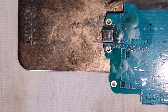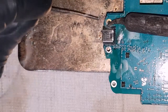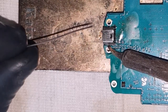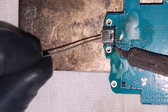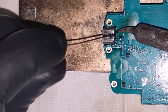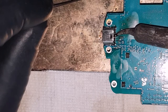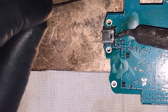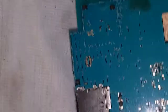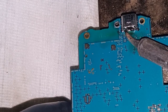I don't tend to use the heat gun here because there's a plastic part inside. Just a little bit of solder on the sides — that's ample. Try not to put too much on because it can leak inside. A little bit on each side, get that to flow right through. I usually put it on the tip of my soldering iron, then tin and apply it to the leads and pad. I'm happy with a few bridges — we can always fix those with a bit of flux.